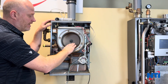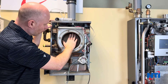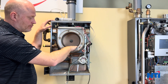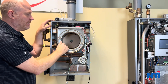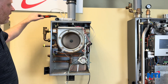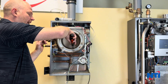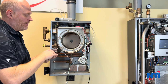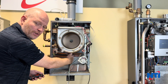Set your burner to one side. Now you're going to use the NTI cleaning disc, or just a piece of plastic or cardboard, to cover up the disc in the back. Take your scrub brush and scrub, flushing lots of water down through and in between these tubes. On water tube boilers you're going to want to use something like the NTI cleaning tool — this is a representation of one. You want to get down in between these tubes and scrape, pouring water down through here. All the dirt is going to flush out through the condensate drain.